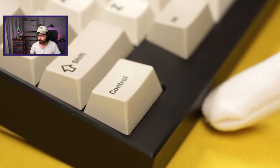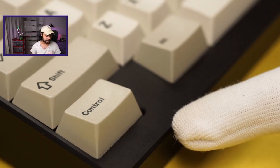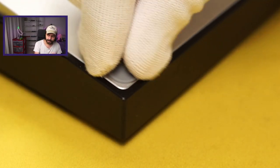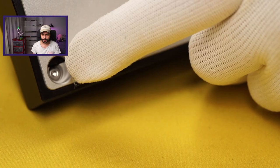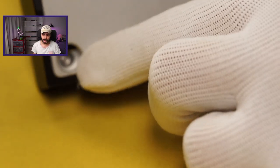On the macro cam we can see a little bit of discoloration along the black anodization, but with the naked eye it looks fantastic. One thing I wanted to hit on is actually the screw areas — under all six of these feet, we can see the screw mount location. I really like the attention to detail with the small little chamfers on each of the three ledges before we get the screw in there, which looks fantastic. The fitment of the top and bottom piece is pretty darn good, and if you look very closely at the silver bottom piece, you can see another very small chamfer.